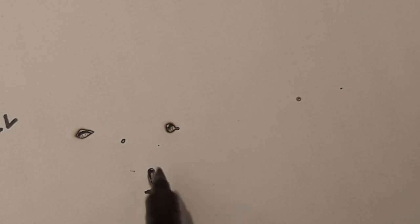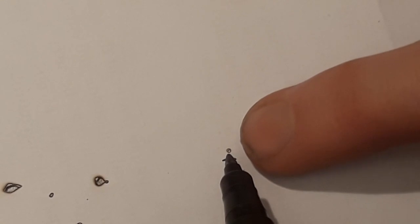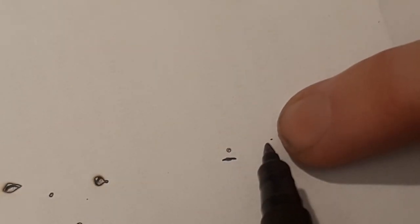Let's take a close look at the spot we just made. We've got the spot that we had first with just the collimator lens — and as you can see, it's not round, and it's quite a big spot. Of course it depends on how long the laser is on — the longer it's on, the more the paper burns. And here is the spot we made using the prisms and the lens — this is very circular. With just a very small laser duration, these spots are quite acceptable.